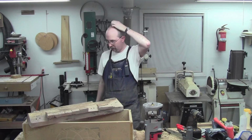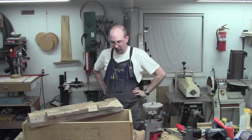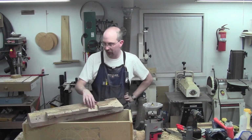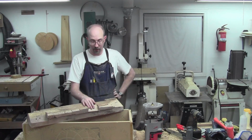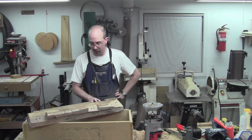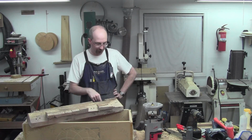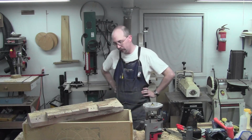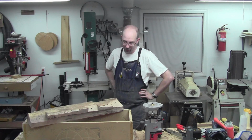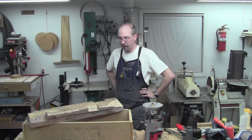So, yeah. Overall, I'm pleased with progress such as it is. And I've decided I'm not going to use the 1/4 inch holes as is. I'm going to use them as guides for dowel centers, and then I'll drill them out for bigger dowels. I'll use probably 1/2 inch or more dowels for that to get a good deep penetration and a good deep socket. That way it'll really be held well. But yeah, so that is the start of the center log, I guess.